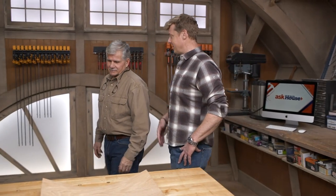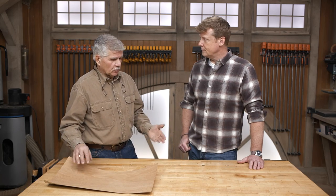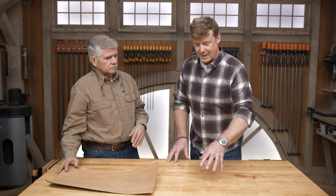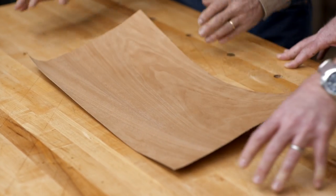Tommy, that is just awesome — I love that transformation. I love taking an old door like that and giving it new life. When it comes to old doors, when people hear a door that's a hundred years old, they're probably thinking it's a solid piece of wood. Most of the time when you say a solid wood door, people don't realize the core could be individual pieces of wood glued together. The benefit is those individual pieces actually give the door more stability than one solid piece. We think the rail or stile is one piece, but that's not necessarily as stable. They build it that way and then cover it with the veneer — cover it with the species you want — and that gives you a beautiful, stable door.